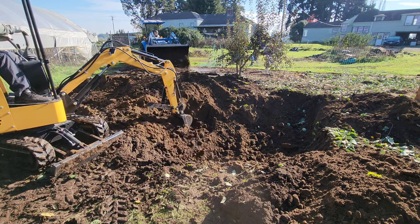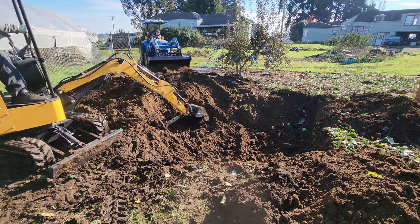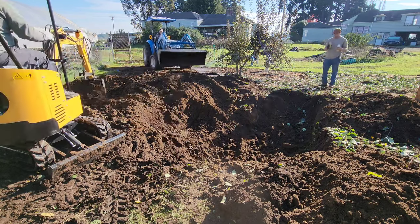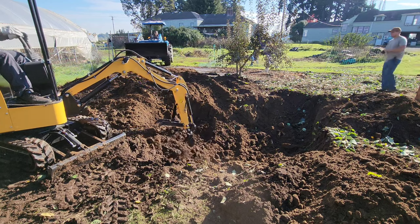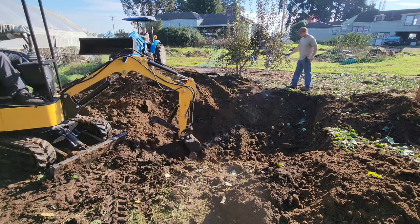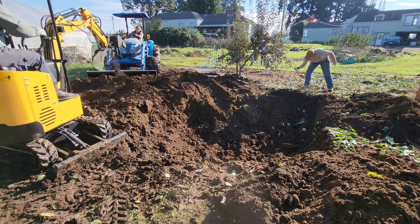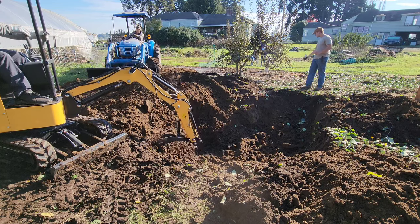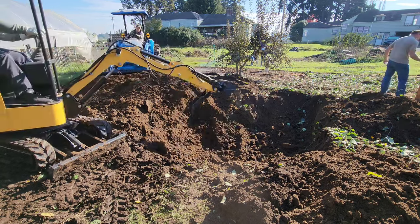As far as how long they will run, or how many hours you should expect out of it, I would not be surprised to see several thousand hours out of these. Really, the wear points are going to be your tracks. They're rubber that's steel braided, but tracks do wear out. If you don't keep it greased, then the bushings and the pins at each joint will probably get loose too. Those are common wear points on an excavator.